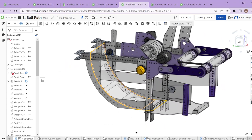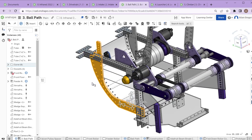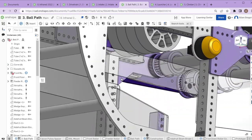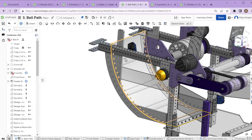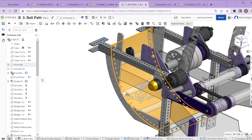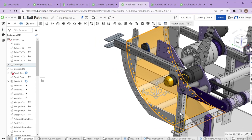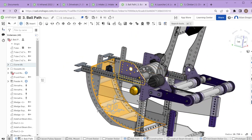The other parts of the ball path include the side plates cut out of quarter-inch polycarbonate with tubes running across to provide side-to-side structure. There's a thin piece of bent polycarbonate that we laser cut and then zip-tie to these tubes, making the curve we need so the ball can go up and get into the launcher.